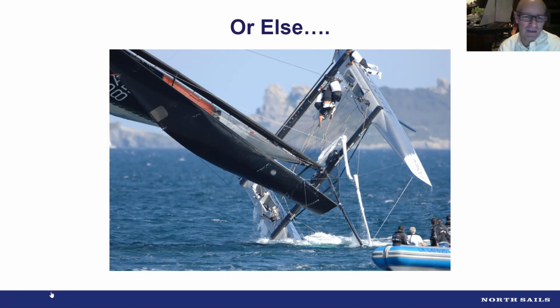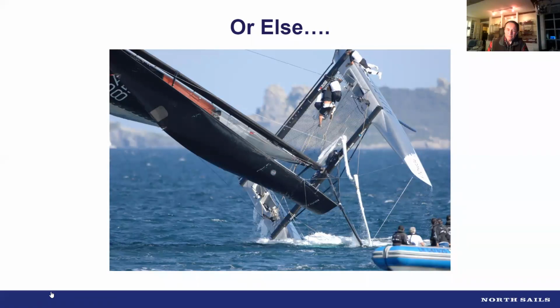One thing, Stan, is that multi-hulls have the advantage of not heeling as much compared to a monohull, and that has a huge effect on the aerodynamics of the sail. So if you were imagining a boat sailing upwind, with the same true wind angle, and you were to take that boat and heel it 90 degrees, but not have it hit the water, and the boat is still facing the same way, what are the sails doing at that point? Yeah. They're flapping, right? Yeah.